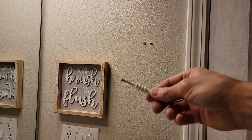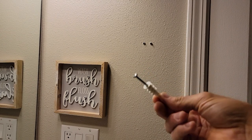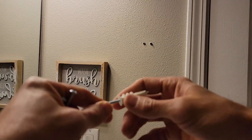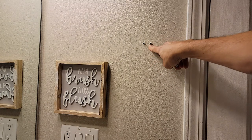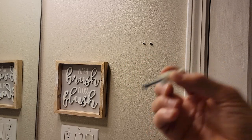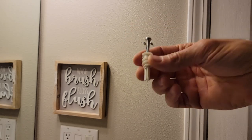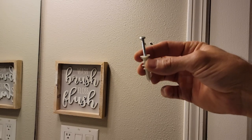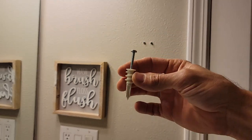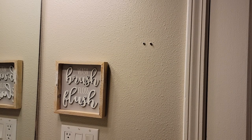This is what I'm talking about — these guys right here. They're rated for 50 pounds. You can get heavier ones but these are super heavy duty, the plastic's really strong. When you screw it in there it's not going to strip out. Really good investment if you hang stuff in your house. You can get a box of 50 of these for like six bucks or something — I'll link in the description below. These are like the best kind of wall anchors I've come across so far if you're just dealing with sheetrock.